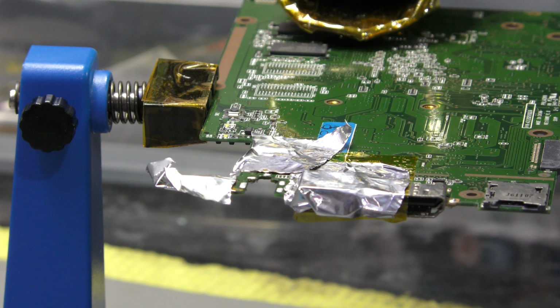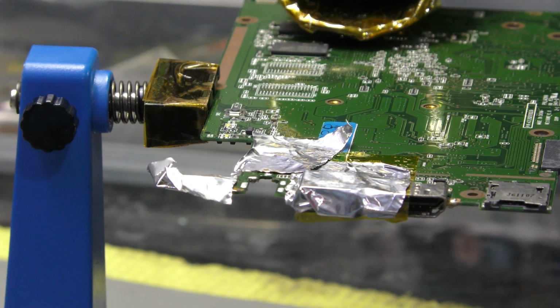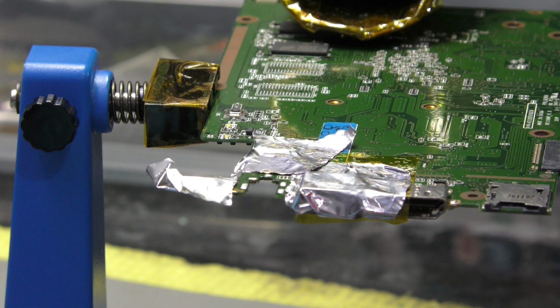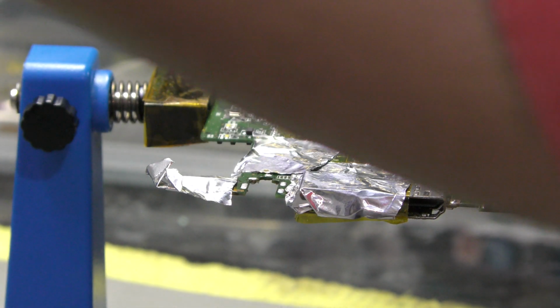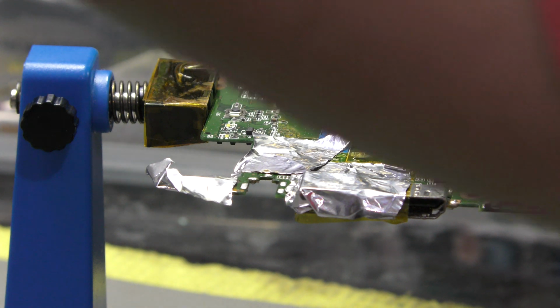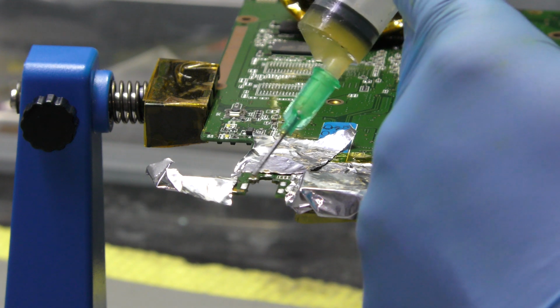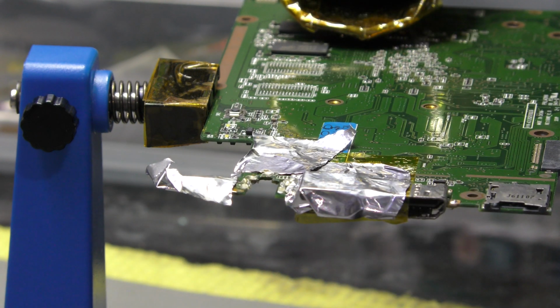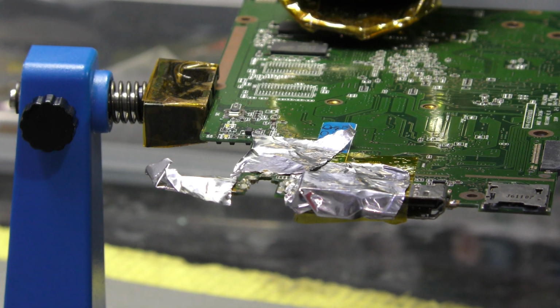I've looked everywhere, including AliExpress. Absolutely everywhere, and it's not available. I could not find it. Right, okay, so we'll wait for that to turn off anyway. In the meantime, let me apply a bit more flux, start clearing these pads out, so I can drop that port in and crack on with it.